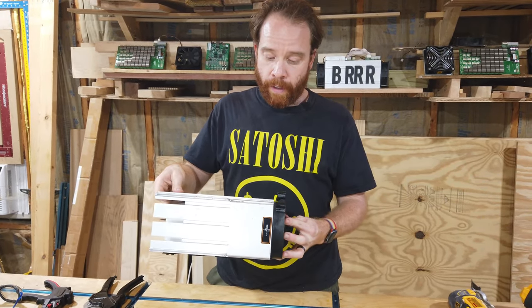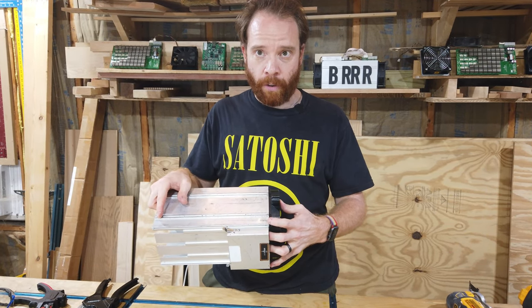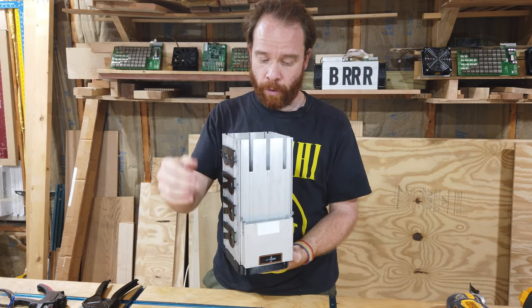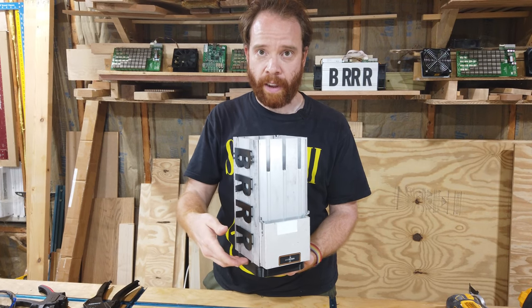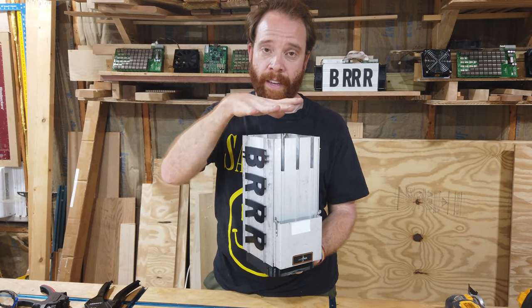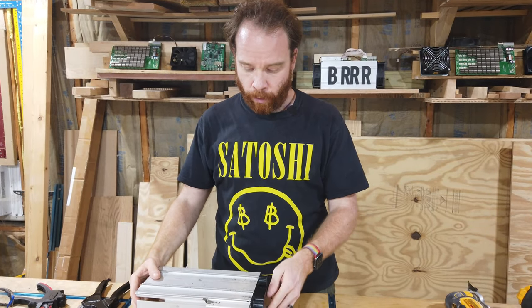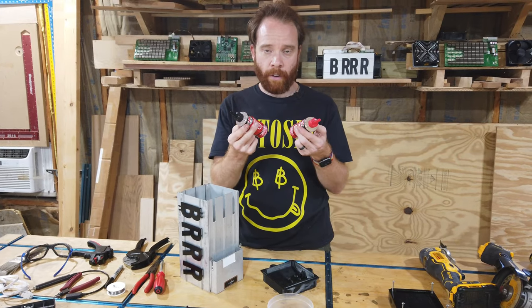Now, in order for this to all work, we need an oil-tight seal here, because we have some gravity to overtake. So if the oil doesn't go around, if the seal is not tight, the oil will just spit out of here and the system wouldn't work. So we need to glue the casing to the injector plate. And in order to do this, we're gonna use just regular epoxy.